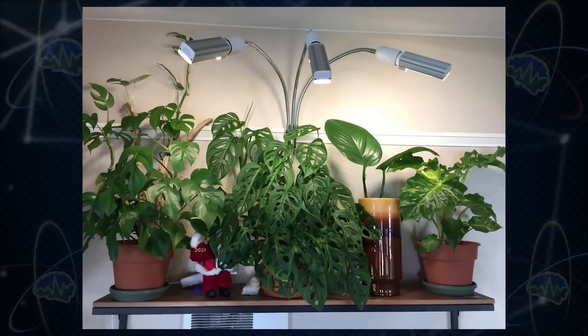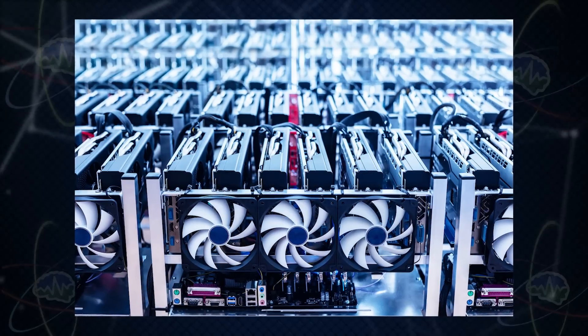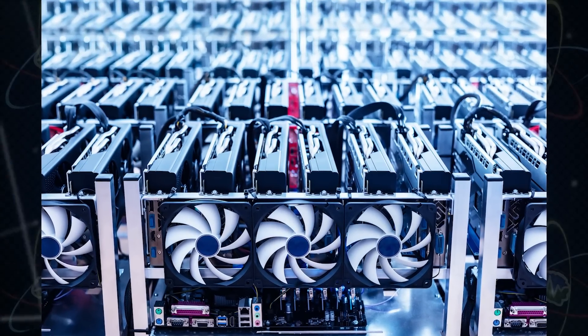With the transfer switch, you control whether circuits are on battery or grid even when the grid is supplying power. So if you're making solar, you can actually run circuits in your house off battery-backed solar. One use case: grow lights — you could grow stuff at home because if the lights shut off it's just a cloudy day to a plant. Those bulbs usually take a lot of power. Another use: Bitcoin mining or anything that uses a lot of energy you don't want to pay for. The system goes up to 2,400 watts of solar input from the unit itself.